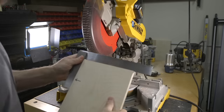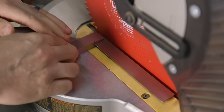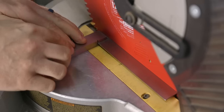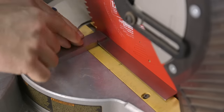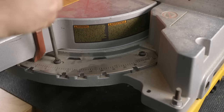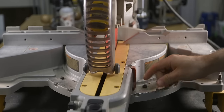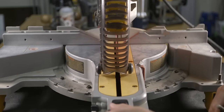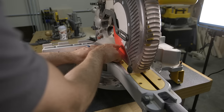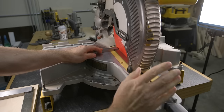Now let's move on to look at how to make those adjustments on a single fence saw. First step: make a test cut. This one is looking pretty good but let's double check using the square against the fence and blade. As you can see on the 12-inch saw, there's a lot more blade to work with and you can get the square to fit against the blade without touching any teeth, which also makes it easier to use feeler gauges. I'm noticing a slight gap closest to the fence, so on this saw we can adjust the detent — the first step is to loosen all the screws holding the detent in place, leaving two of them slightly tighter than the others so you can make adjustments without it moving too easily. Double check that the saw is still locked into the zero-degree detent and move the square tight to the blade without putting too much pressure.